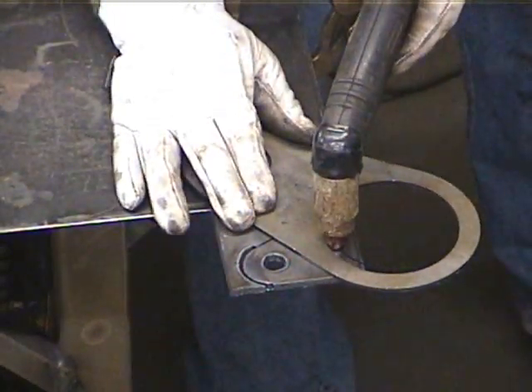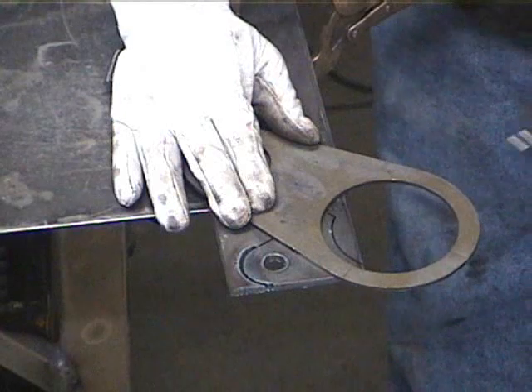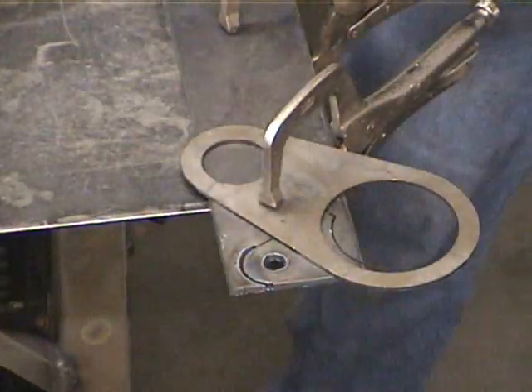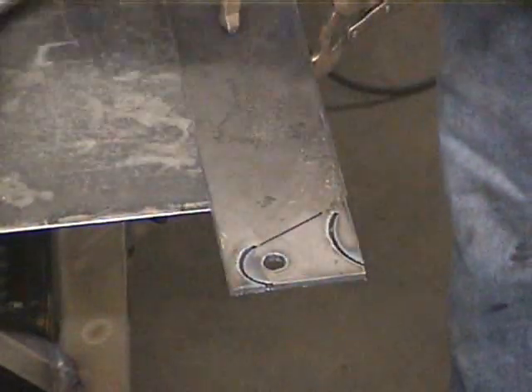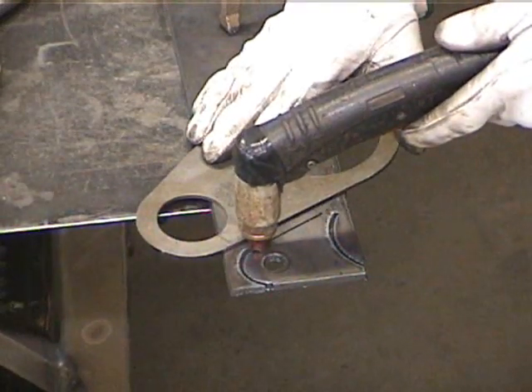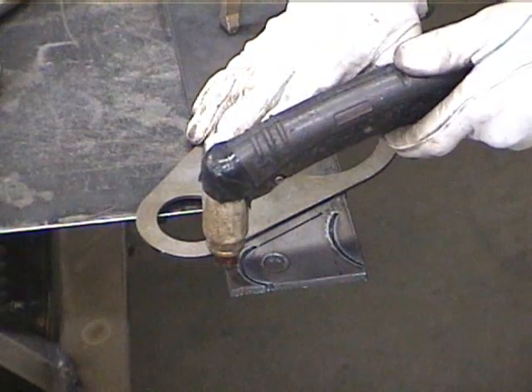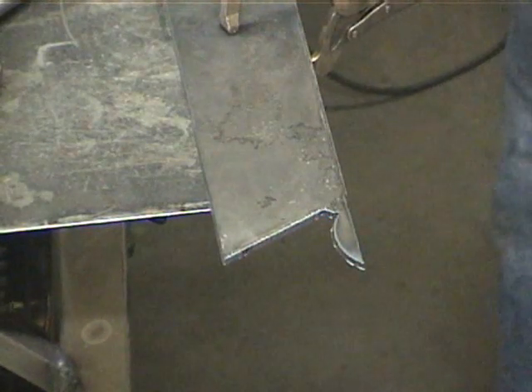Use the plasma cutter to line up your offset since there's no centerline marks to go off of. Clamp in place and then make that cut. Then finish off the shock tab by just using the edge as a straight edge — line up and make that cut. Clean up the last little corner by hand and there we have a shock tab.